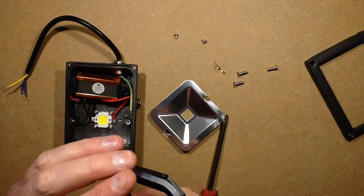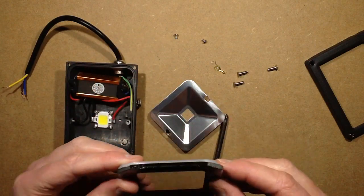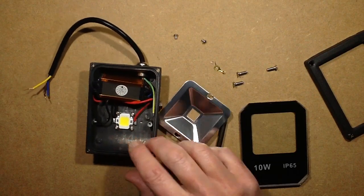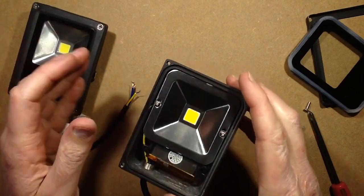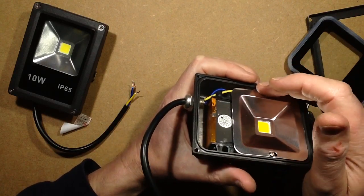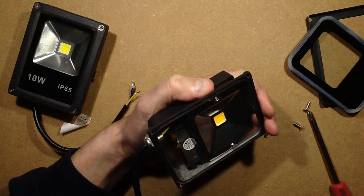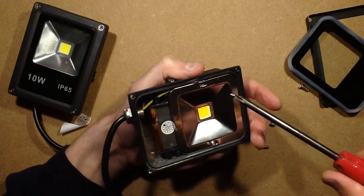I think these things are cute — these tiny little lights are really neat. There's where the glass fragments come from: they tend to chip them off at the edge here during assembly, it tends to be quite rough, and it's not uncommon to find a little bit of glass inside but it's no great deal. Yeah, that's very impressive — that has surprised me greatly. Definite winner. I've opened the other one — I bought two of these, one cold white and one warm white at the same price. I noticed on opening this one that both of them showed an earth connection, but when you open it up the lug is loose.